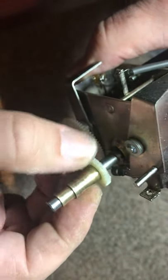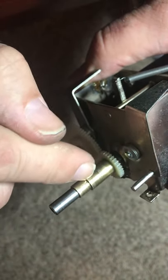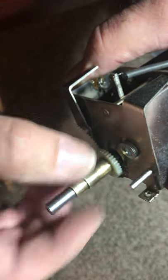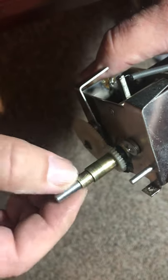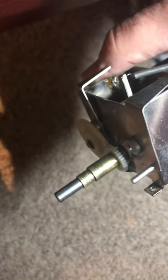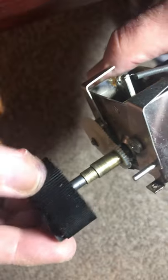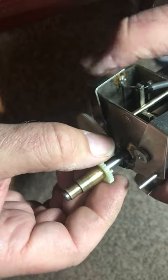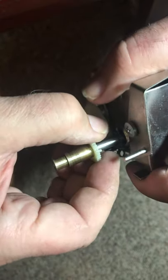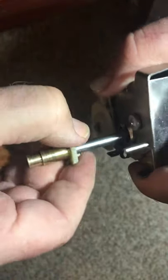Here's the PTO again itself. This has to be smooth — I tried to get this smoothed up today. You don't want to put oil in the bushing or inside here. When people tighten the knob, it puts gashes into this shaft and then I can't get it off, so I tried to get the gashes off it. You don't want to yank this too hard. The little washer in question was right here.